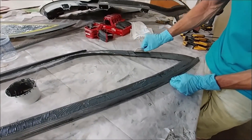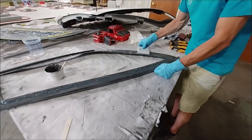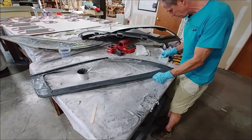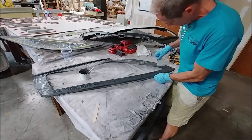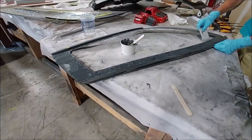Devin mixed up some hysol for me and there was time to bond the window to the frame. As you can see I'm using a little plastic trowel to spread the hysol out nicely, because we're only putting basically a 20-thou thickness there — it's such a tight fit with that frame to the acrylic, so it didn't need very much hysol at all.